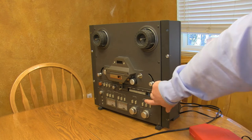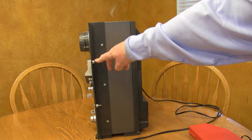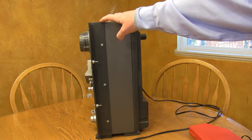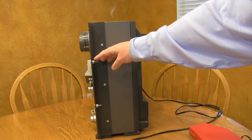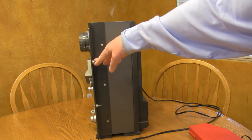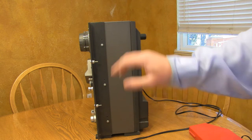The transport panel here is sunken into the chassis, so that's an easy fix. Another fairly easy fix: I don't know why TASCAM did this — I had this problem when I had an 80-8 myself — but if you try to put this in a rack, the reels will interfere with the face of it. The way this person dealt with it was by putting washers and nuts back here to act as standoffs. What I'd like to do is drill some holes in the rack ears to make it automatically sit further forward and not need that.